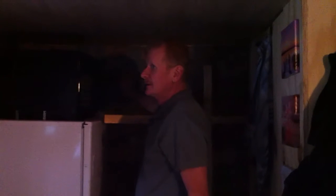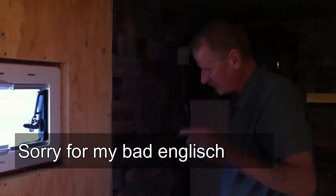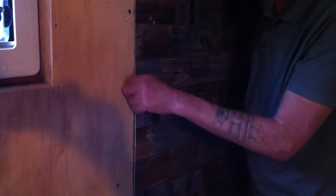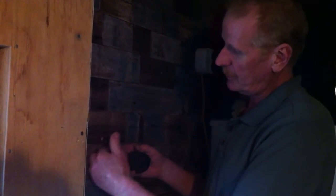The first two pieces of vinyl are ready. You might ask why I don't glue the vinyl in one piece on this wall. Well, that's the reason — here is a seam, the beginning and the end of the wooden plate. It's going to expand and contract when the moisture or temperature changes — the temperature goes up and down, the moisture goes up and down. In Dutch we say the wood works.